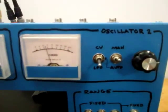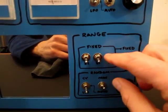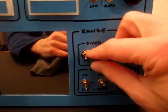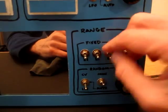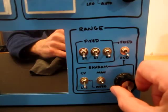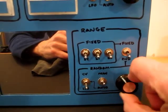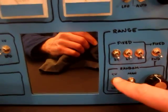And the second oscillator — same thing. Here is the range, which is basically eight different capacitors. You can select in fixed mode which of the capacitors via these three in binary. Or you can put it in pseudo-random mode and control the speed of the random number generator via this, again either manually or automatically through LFO and CV.